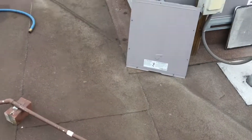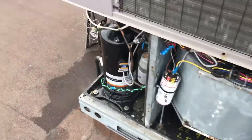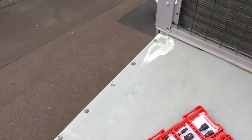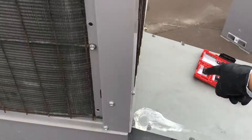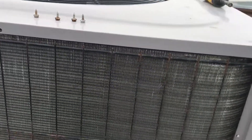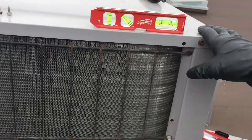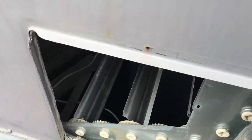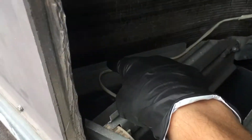We're going to check this anyway. This is the outlet over here — look, here's the outlet. This is supposed to be the low side of the unit. Look where the bubble is — they have the unit backwards. They have the high side over here and the low side over there. There's no leak downstairs yet, but it comes to borderline — it fills up inside here.